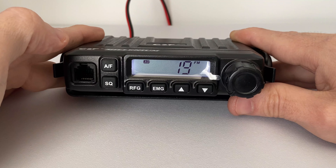Make sure it's sitting nice and secure. Do the same with the second one and drop it down on both pins, and again press firmly down — that should be it. All we've done is we've just lifted the two jumpers and moved them across so they are linking both of the two jumper pins on OP1 and OP2.